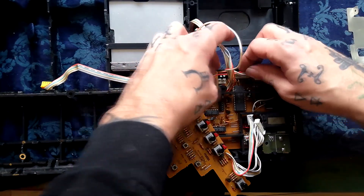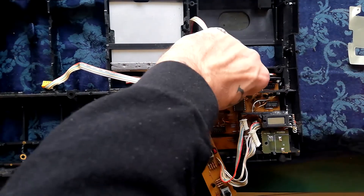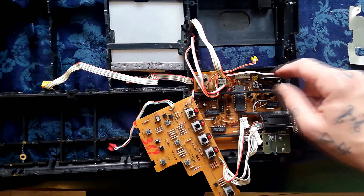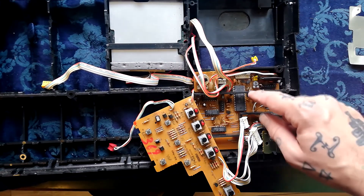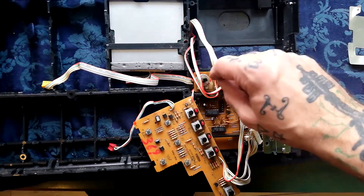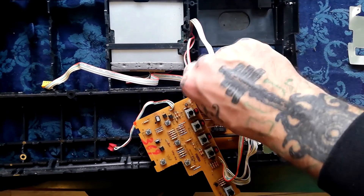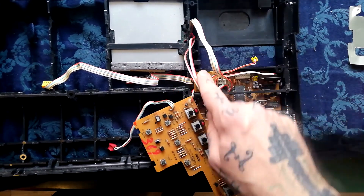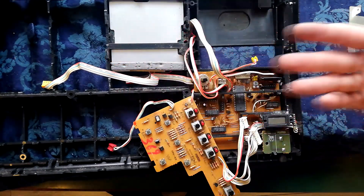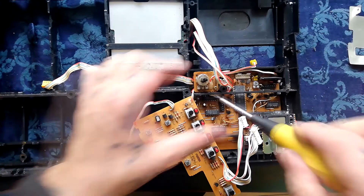White ones with different numbers of pins - you can match them up that way. I need to take this pitch control out now. The pitch control is just going to this one yellow header here. There's the trim pot for the mean pitch, so at 12 o'clock this should be three and three-quarter inches per second. If you have a 1kHz test tape, you would adjust that with this in the indent at 12 o'clock to make sure it was playing back at one kilohertz in the center. You can make adjustments of about plus or minus 10 percent of overall speed to compensate if you're moving on to recording from another machine that wasn't as well calibrated.